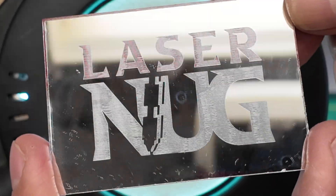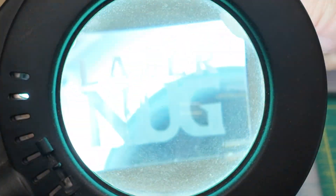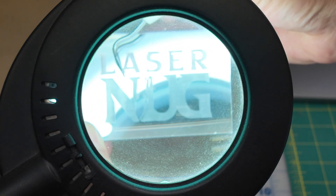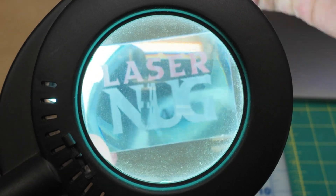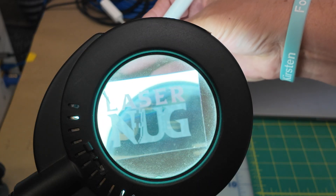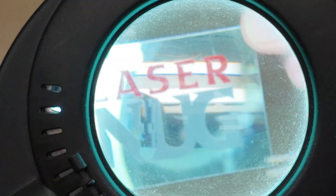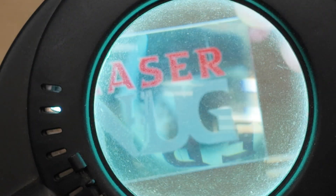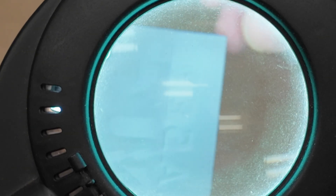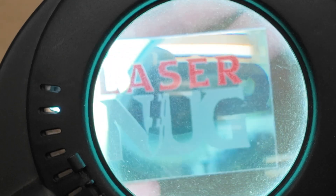The next test I left at 300 LPI — lines per inch — and the resolution is insufficient because it leaves lines. It's not tight enough, so you can literally see the engraved lines almost like a grid throughout every letter once you've painted, because you haven't fully removed that grey mirrored coating off the back. Where I landed was 600 LPI, which gave me a beautiful clean consistent coloring from the paint. The settings are just enough to remove what you need off the back — the LPI is high enough to remove all of that grey mirrored backing without going deep into the clear acrylic itself.